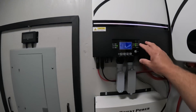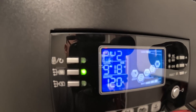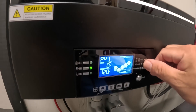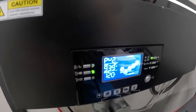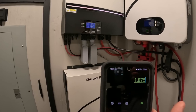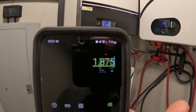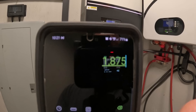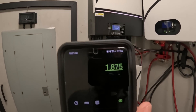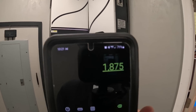It's been literally two minutes since I was last in here. We're seeing 917 watts on one inverter — don't tell me cooling them off doesn't work — and 939 to 945 on the other. We're now at 1,875 watts, up from 1,741. That's a 134-watt increase just from wetting the panels. Now we have a good baseline; let's quickly wash them and see any additional increase from cleaning.